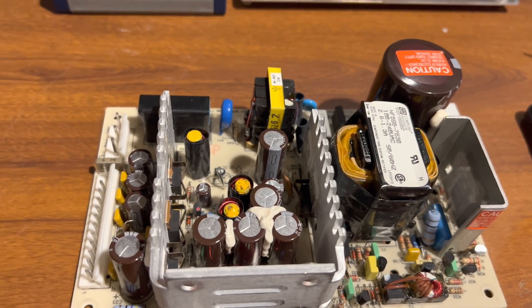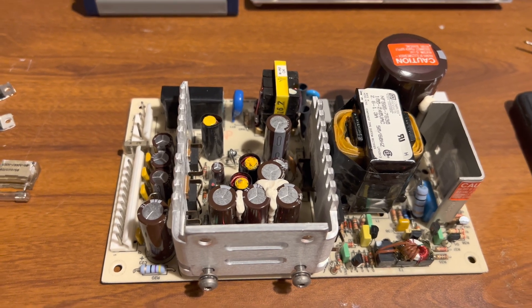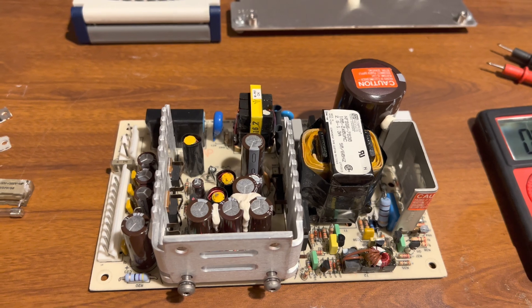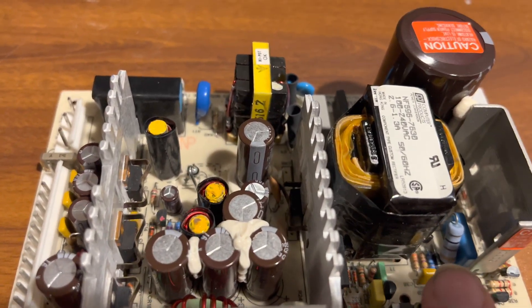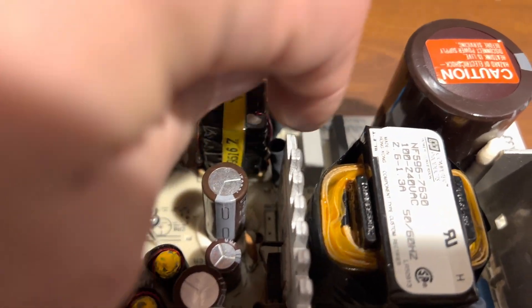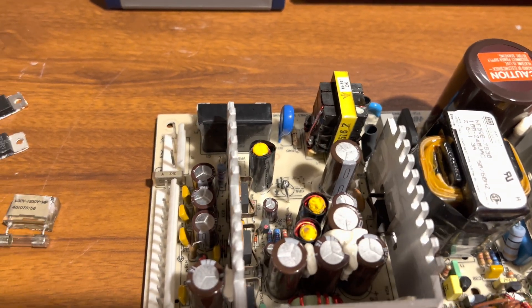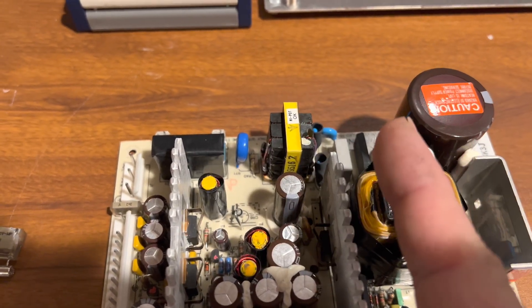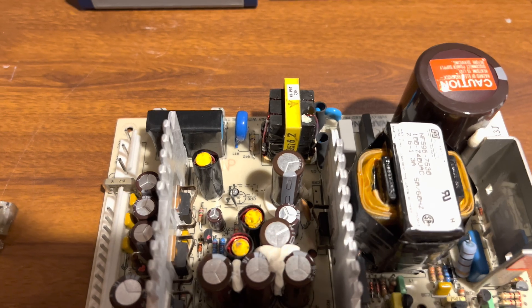The switcher shockingly survived. I may go ahead and change that out, and also change out the other rectifier diode as well, since it did take a lot of stress — just out of precaution. But overall, everything else on the power supply pretty much survived. I'll also be changing out this one — the thyristor right there too. The Wima caps you can leave in — they're usually very reliable and never fail. This bridge here is actually good. I'm going to go and test it by putting power on now that I've removed the faulty components. On this side I should get 120 volts, and right after the bridge I should get about 170 volts on the cap.